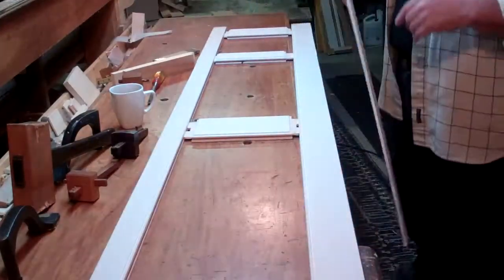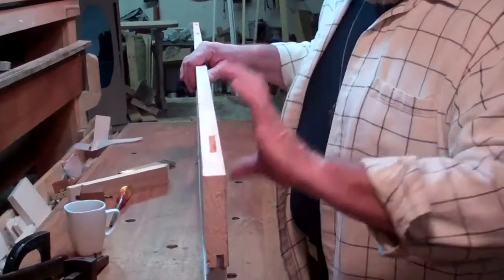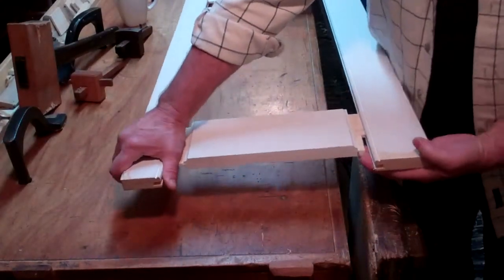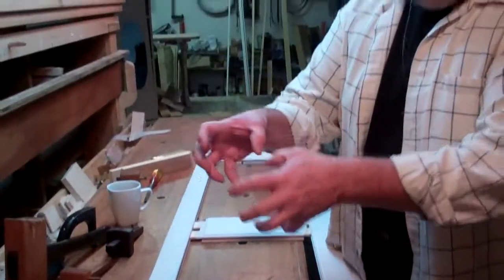The panels go in the grooves that are cut in all the pieces. Now frame and panel work is the stock in trade of the joiner, and basically frame and panel work is mortise and tenon work. The mortise refers to the hole in the stiles. The tenons are the extensions on the rails that slide into those holes — that's what holds them together. It's related to the word 'tenant': they hold that property, and this tenon holds those stiles in place.